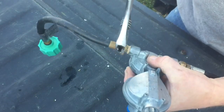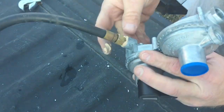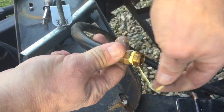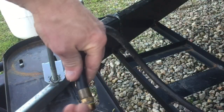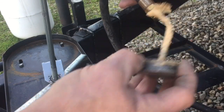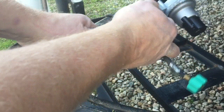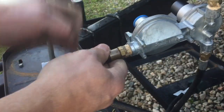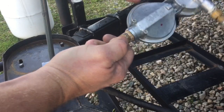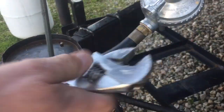I tighten that down as well — make sure it's good and tight, not too tight. I'm going to inspect it and make sure that there's enough pipe thread sealing on there. You can see that they used tape on the RV side here, so I'm going to go ahead and remove that because that won't do anything but get in the way. Once I get that done, I can put some new stuff on. I'll use the brush-on since I've got the can open. Go around all the threads, make sure it covers the first row, and make sure that my hole is clear of thread sealant. Then I bring my valve over and put it on by hand first, of course. Once I get a few threads started into the valve, I'll tighten the rest of the way with the wrench and get it pretty tight.